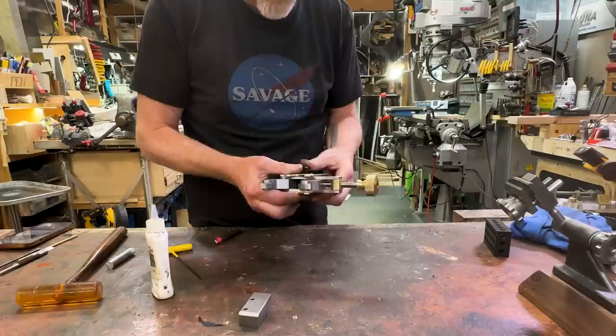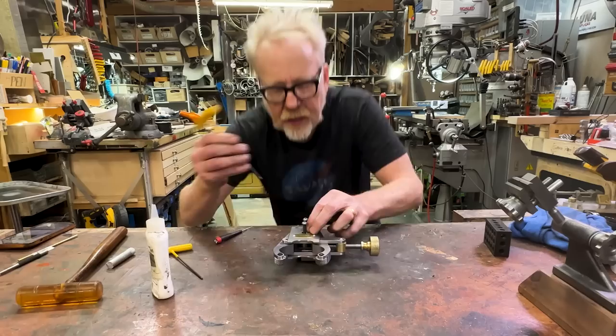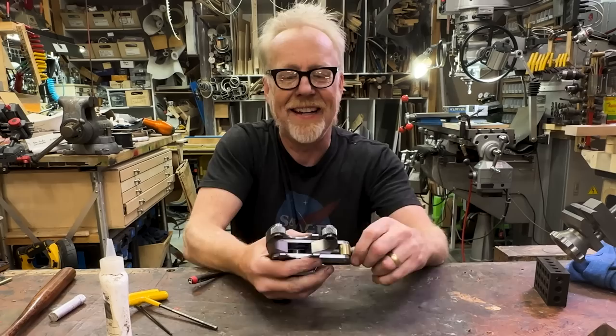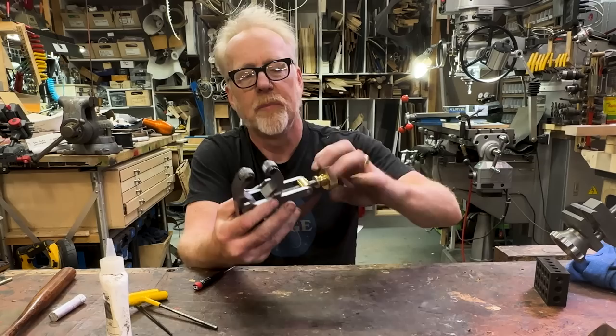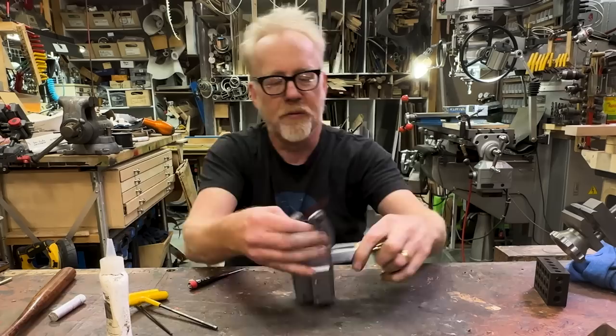Now this guy sits there, and now what's funny is I'll bet you don't need both of these bolts to hold this thing together. I'll bet that is enough. And so you can see, I turn this clockwise to clamp it down. I open it up by turning it counterclockwise. It's self-centering. That's what the spring gives it, both an ability to sit close to center, but also kind of move back and forth. And then we'll clamp this down, and the machine itself is complete.